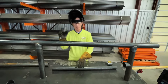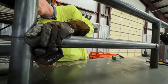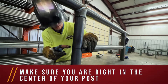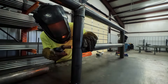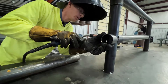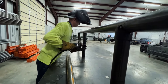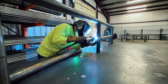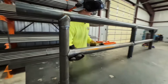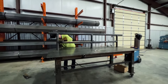I got it tacked on. Now you can pretty much sleeve your next piece over your rail — stick your rail in there. Now you're just going to push it over and on, and make sure you're right in the center there on your post. Now I'm going to tack this. Now we're going to do the same thing on our next rail — we're going to tack this piece on, make sure we're right in the right spot, and we're in line with your top rail, so it's not all crooked. Make sure it's pretty straight. And same thing again, we're going to slide this Pipe Pal over, push it in, make sure we're all the way flush with your Pipe Pal and right on the middle line that we marked, and we're going to tack it.